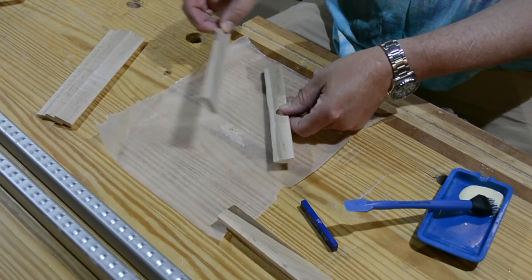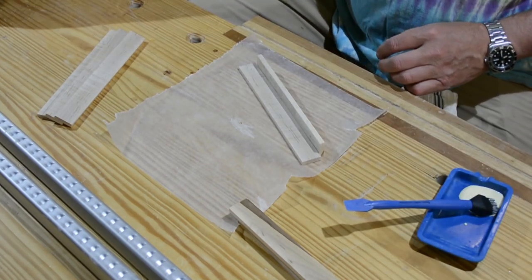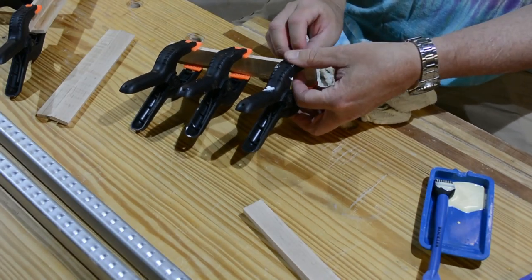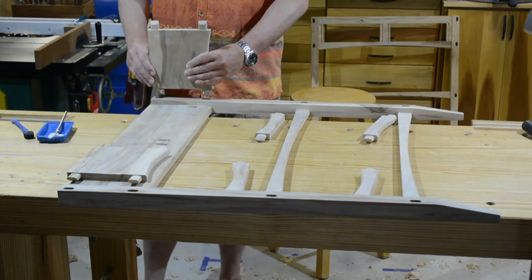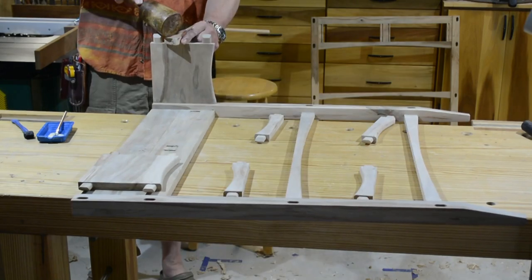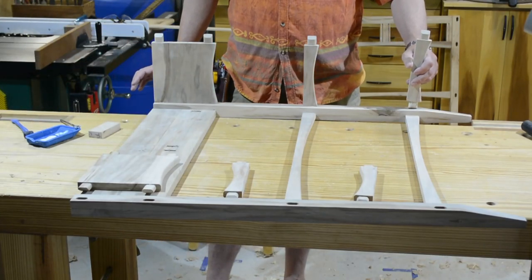To finish the drawer slides, it's just gluing on another quarter inch piece of maple on the bottom of that piece that will go in, that'll hold the drawer to ride on. Carcass glue up is the two sides plus another 16 mortise joints, but like before, they're tight enough that the piece really holds itself in alignment and you don't have to do any complex positioning.